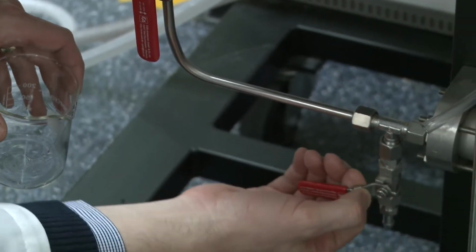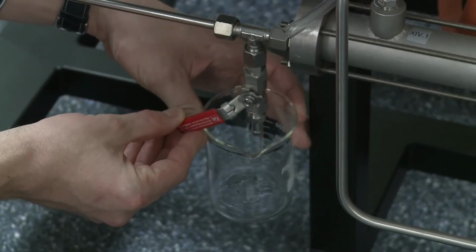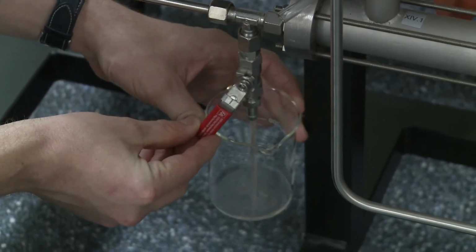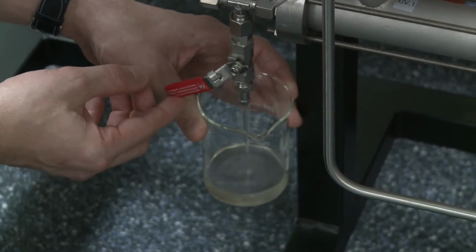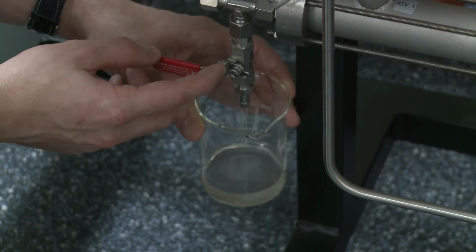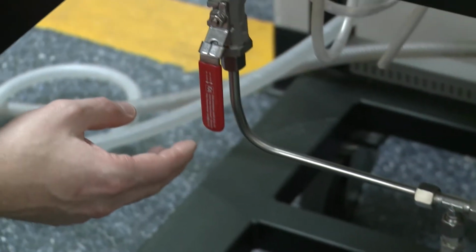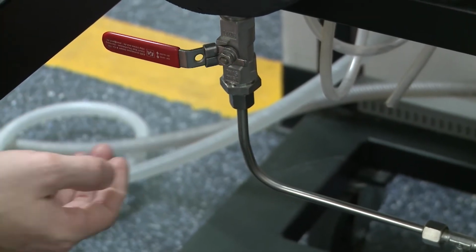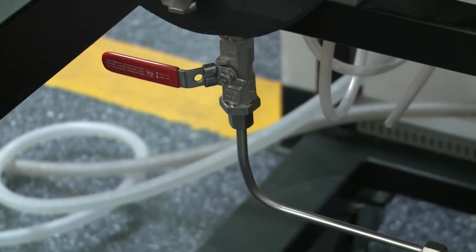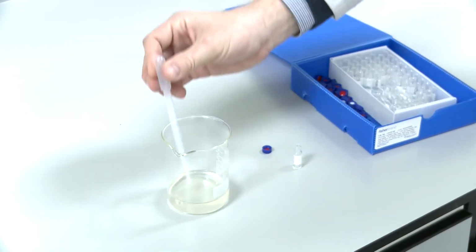The first task we do is open the two valves, and I'm also pulling back a valve lock at the same time. Then we take a small sample down here as well. Now you've got to be very careful. This sample is boiling hot, and you don't have to worry too much about the quantities. I'm still sampling a bit too much here. But with the reboiler, you have such a large volume to sample from, it doesn't really matter how much you take out of there.